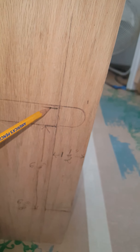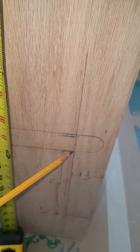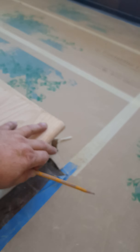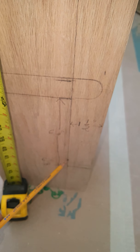I come down here and make a mark at 35 inches. Now that's to the top of the tread. I really want to cut on the bottom of the tread because I want my cut down there where it's hidden, but my cut on top will be seen. That means you'll technically be 36 inches down — add another inch, because these treads are an inch thick. So that will be your actual cut mark. I'll have an inch and a half projecting out past the face of the tread — half an inch plus that measurement — which comes to an inch and a half. That determines my riser cut line right there.